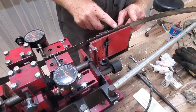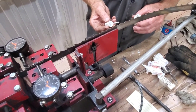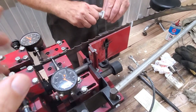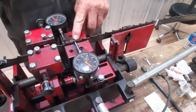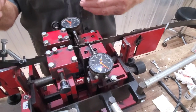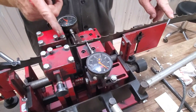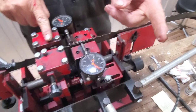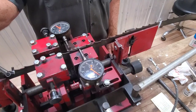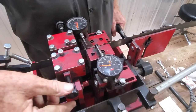Two, three, four — that's spot on. That was five teeth at twenty thousandths. So he knows from right there to right there, that's five teeth going that way. The fifth tooth past the edge of the block — that's your fifth tooth. That's the fifth set of three, so that's the 15th tooth from here. He calls that his right, and that's his fifth tooth set to the left side. He knows that section is set and goes until it comes back around to the white-out mark.